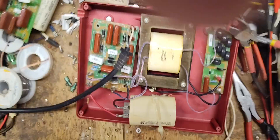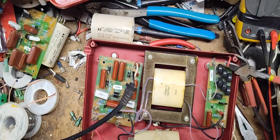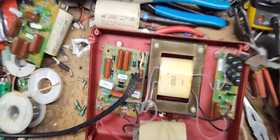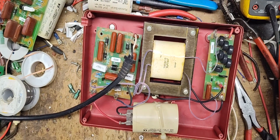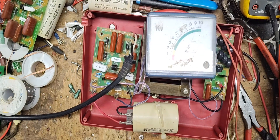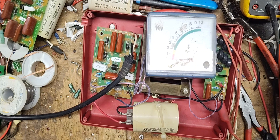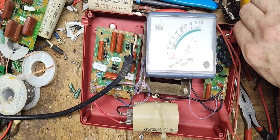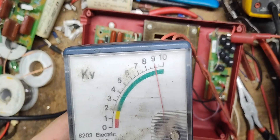You can see the light flashing down inside there - it's probably good to go. Let's put our analog fence tester on there and see what we're getting. There's our ground side and there's our fence side - we're getting 9,000 volts out of it.